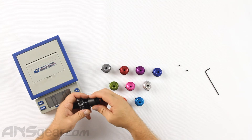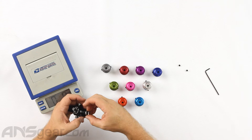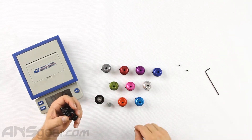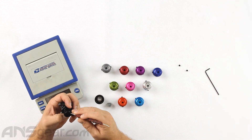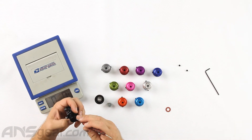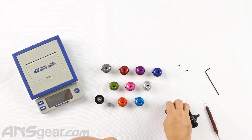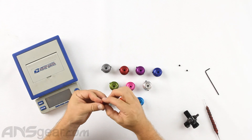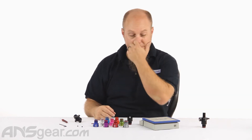As this comes up to the top, I'm going to pull this apart. We've got a couple of different sections in our regulator here. We've got our spring, we've got our piston which is in here, and then underneath that we have some shims. Now these shims control the output pressure of your regulator. As many shims as are in there is what you want to keep in there. You can see right now there are three red shims inside this regulator.